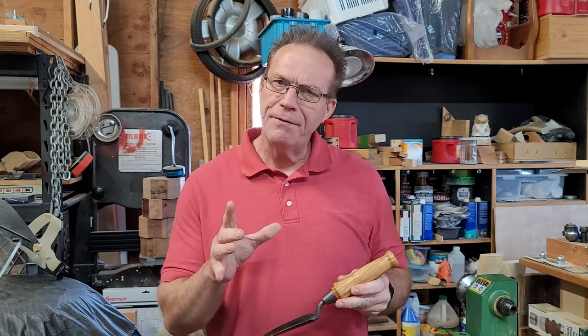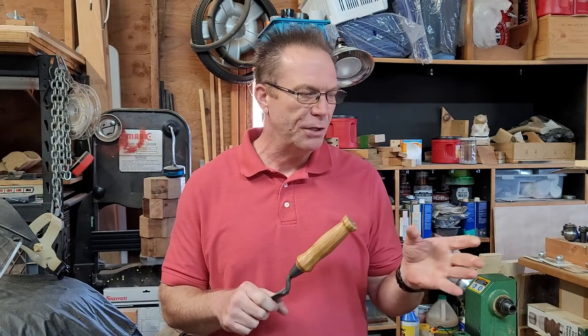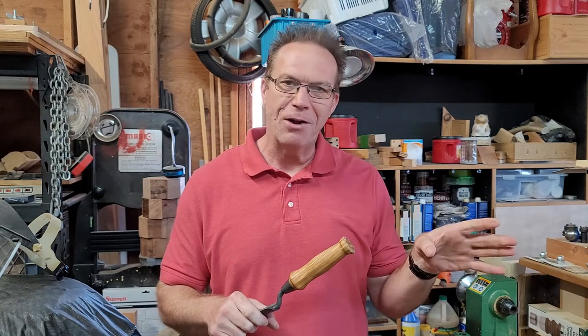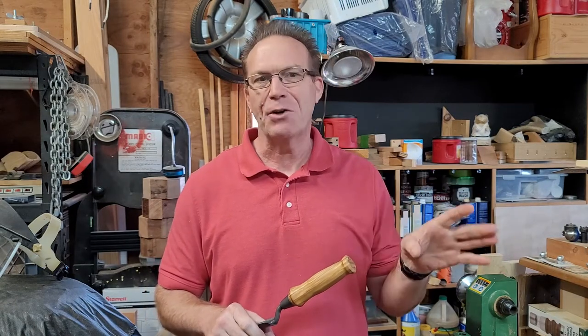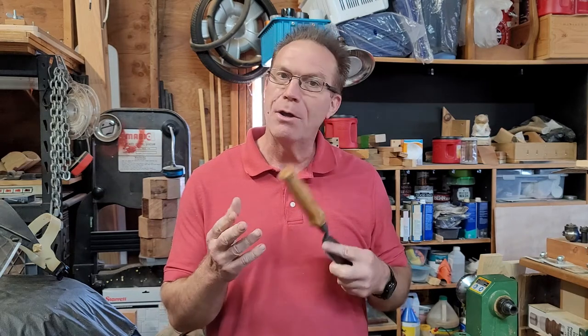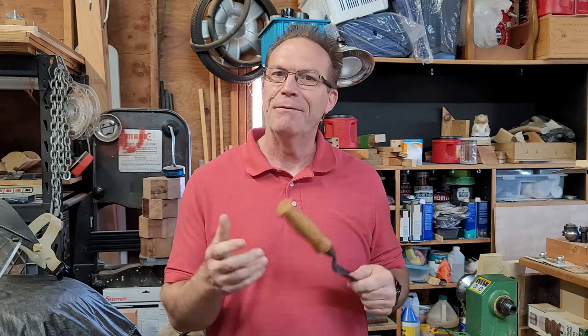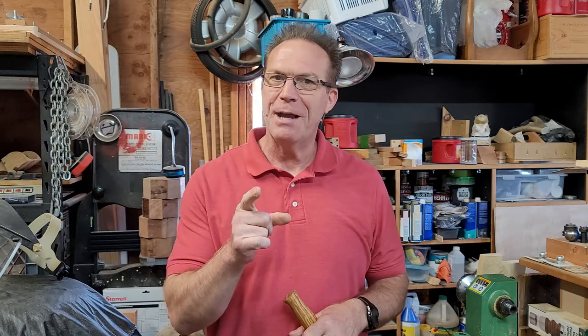Well, thank you for sticking around to the end of the video. As far as a finish, I did put some friction polish on here. However, my mixture was imbalanced. I didn't have enough alcohol on it, and I saw it, but just didn't correct it at the time. Now, what I'm gonna do is follow it up with my mineral oil beeswax mix, and it'll be good to go. So thank you for watching, and until next time, you take care.